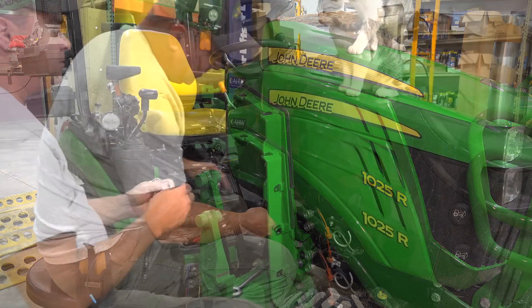The next step is to mount this on the tractor — this part up here — and then put the couplers on this end. We'll put this right on here. One of the four hoses, the blue hose, needs this orifice on it — they send you the orifice. It says this is for lift extend, so I wonder if it slows down the lift a little. It's just a little bit smaller, so the orifice here restricts the flow just a little bit so that it lifts slower.